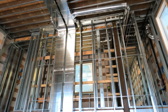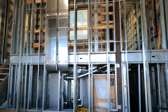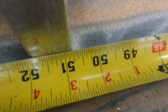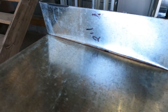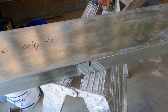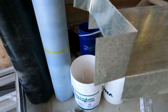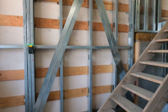You've got to build the steel just as tight around the duct as you can, making sure the drywall will pass freely and hiding as much of the steel as possible at the top. They're dropping a ceiling in there — we already built the ceiling. Building a header: measure in between the two studs, hard side to hard side, with the hard sides both facing inward. I add two inches to either end for the shoes — so it's 50 and three-quarters, I cut the whole thing at 54 and three-quarters and put two-inch shoes on either end.